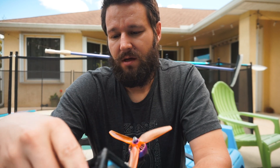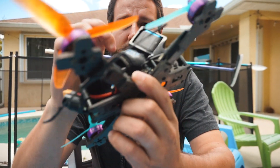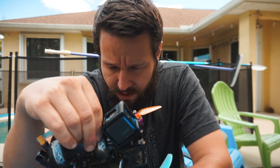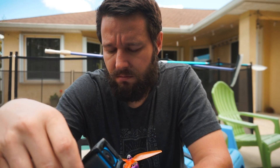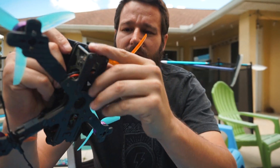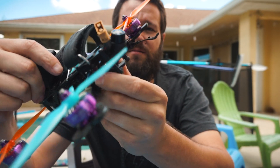For video, this is the Holybro Atlatl HV V2. It's an alright VTX — not as good range-wise as the Unify or Tramp, but relatively inexpensive and very dependable as long as you don't overheat it. I've only smoked one or two and it was my fault — don't leave your quad sitting in the sun at 800 milliwatts for 10 minutes. I'm running a RunCam going into that and a little Lumenier Axii stubby antenna coming out in a 3D-printed mount.